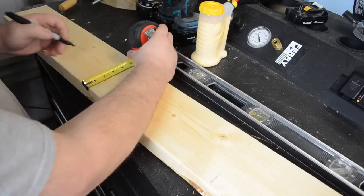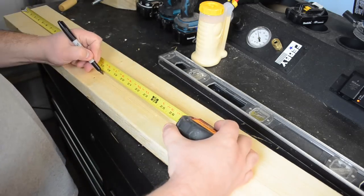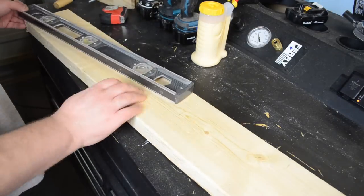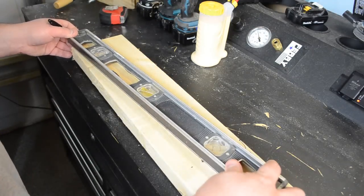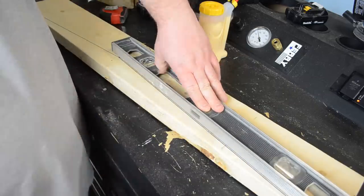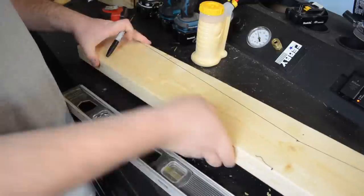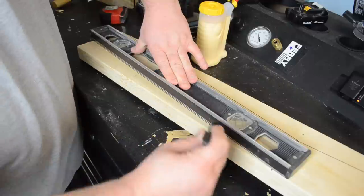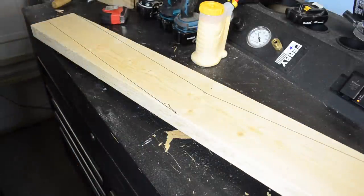On the back support slash legs, you can measure down on the board 20 inches and then in 2 inches from the edge. You can then connect that point to its nearest corners using a straight edge. And then whatever end of the board you want to be the back support, measure 20 inches, basically bisecting the board lengthwise, and then 2 inches from the edge on one end to give the back a little bit of an angle.